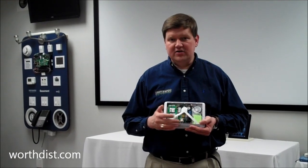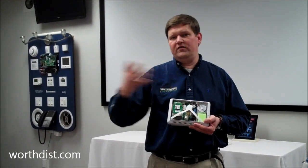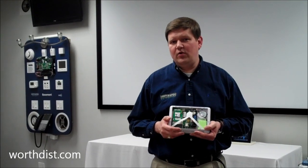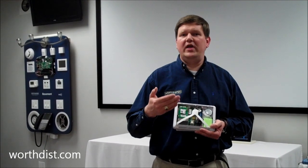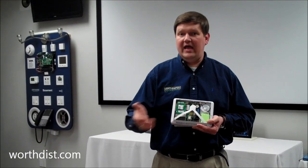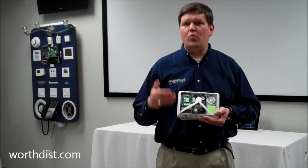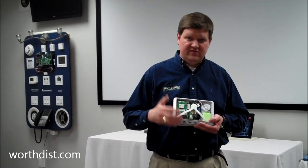Secondly, I also have a Z-Wave chip built into this unit, which means that all of the home automation features associated with Z-Wave are now available through this controller. And then as well, there is a wireless receiver for the 2-gig transmissions, but we can also receive the popular Ademco 5800 series wireless, and with some assistance from a company called Resolution Products, which I'll show you, we can also receive popular formats from NAPCO or DSC, which means from a takeover perspective, this is the controller of choice.